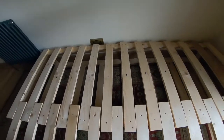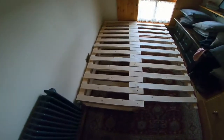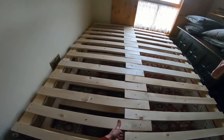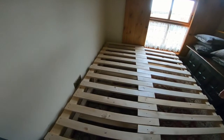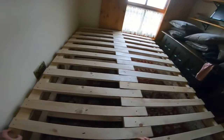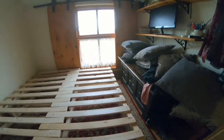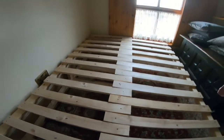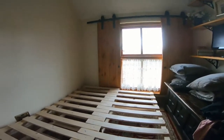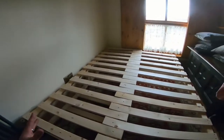Let me pull it out to its full width. You can see that piece of wood there is the stop. I've got to put the legs on. Now when you're making this there are a couple of design things to point out. Chamfer the underneath of the movable pieces and chamfer the sides so they ride over each other — two square edges butting up tend to catch. Originally I was going to use 3x2s across, which would have lost the bed width by maybe six inches. Instead I ripped one of the 3x2s down to one inch and used a piece of 2x2, which gained me about three to four inches in travel. The bed is now 58 inches wide — just short of five foot — and I'll have two 2-foot-6 mattresses on there.